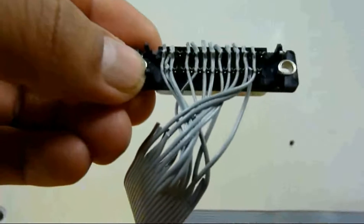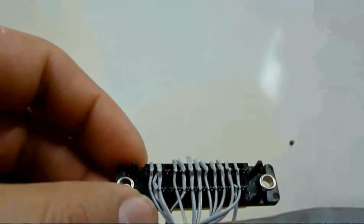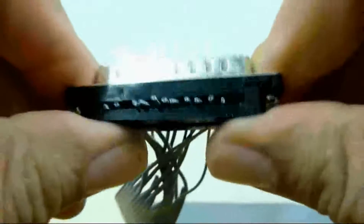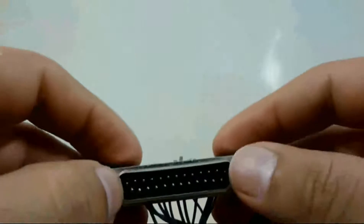Once you go through each cable, it'll look something like this — some cables crossing over. This is probably the trickiest part of the whole process, but once done, grab the top part of the 25-pin connector and crimp it on. Put it between two flat surfaces and apply a lot of pressure to make sure it's really secure. That is pretty much the end of this video. Thank you for watching, and your cable is now ready to be tested. Ask your instructor to lend you the electronic testing equipment.